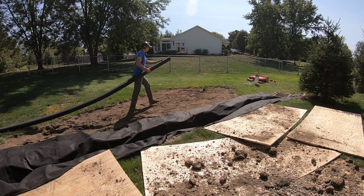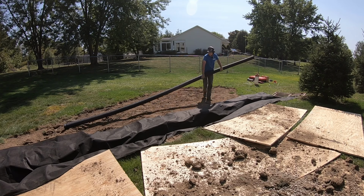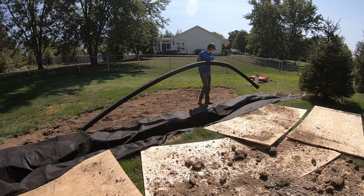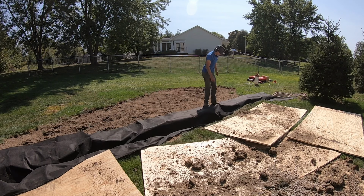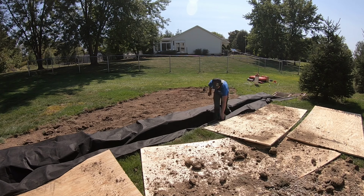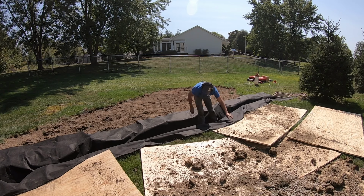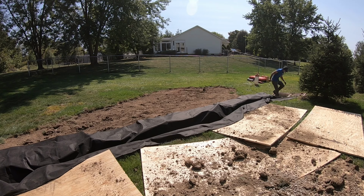Yeah. We'll go ahead and swap our pipe in here now. This is double wall 4-inch. Has a similar crush rating. Actually, I think it exceeds the crush rating of SDR 35 PVC. And it's also quicker to install, and I like the way it's perforated much better. It's got little slits in it rather than big holes. It's got more of them, more slits.